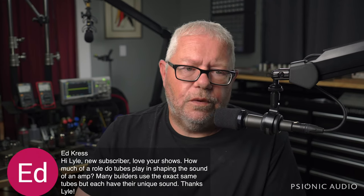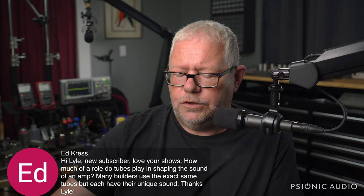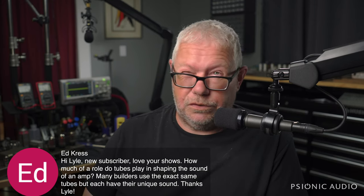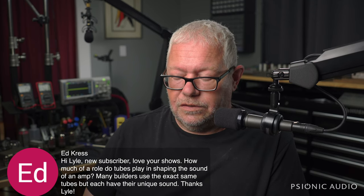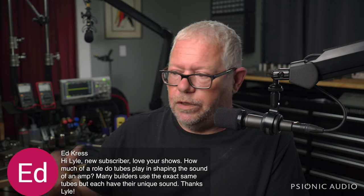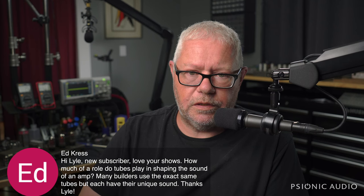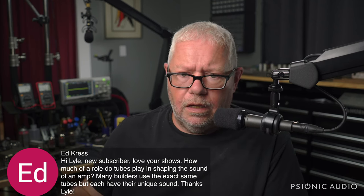That's a really interesting question. Thank you for your comment. How much role do tubes play in the sound? Well, tubes play a huge role, but it's not the only one. And magical qualities are ascribed to output tubes in a lot of cases, I find, because say someone has played only Fenders and really good Marshalls, and they have very different output transformers and very different speaker cabs, very different negative feedback structures, and very different phase inverters.